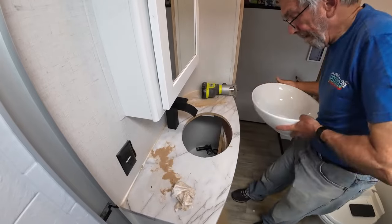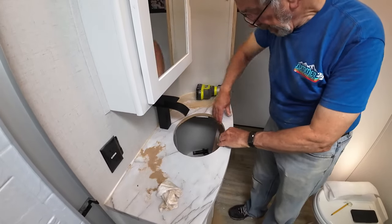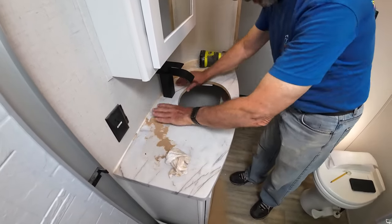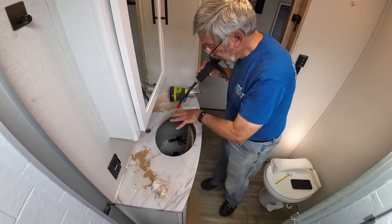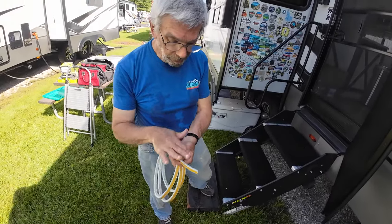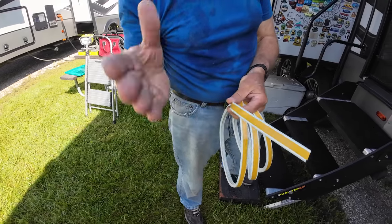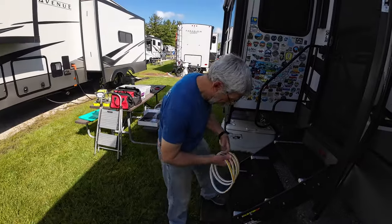We'll take this out. What I have is a draft excluder which I put around the edge of the hole here, just to make it flush with the top. That gives it something to cushion against — there's no other way to fix it in. So we'll sit it down in there, put the insulation stuff around it, then sit the tub in, then we can caulk around. This is what I'm going to put on the inside of the hole — a draft excluder — it'll give it a little cushioning and also take up the space down below because it's a shaped vessel sink.